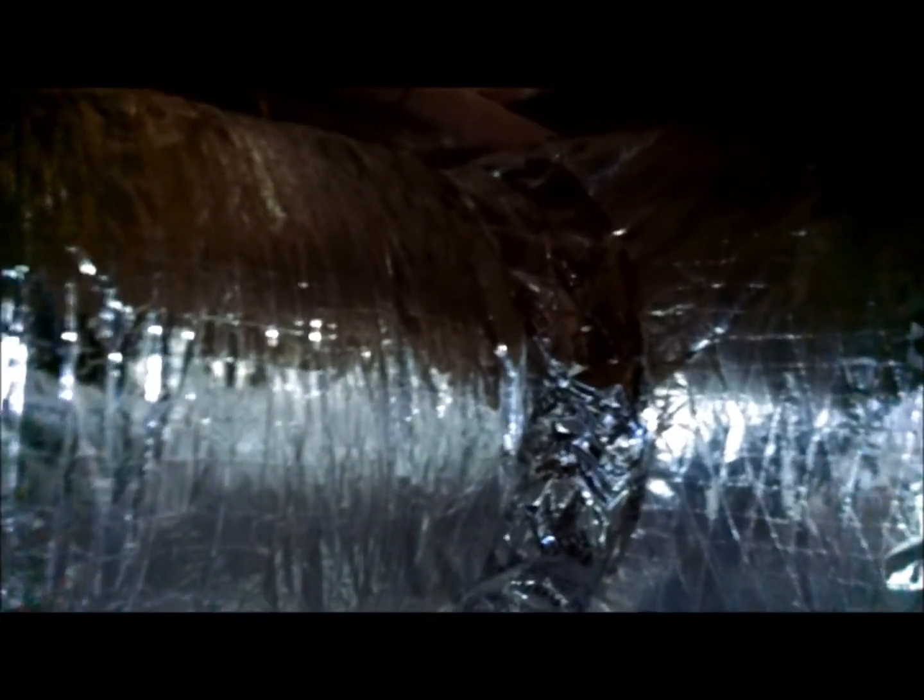and the flex connect, right there at the damper. I want you to see how that's nice and taped off all the way around the collar, and there is literally no airflow coming out around this collar right here, which is very important. That means that the air that is coming out of the coil or out of the furnace is the actual air temperature as close as possible to the air temperature coming out of your vent. So instead of losing 10 degrees from the unit to the vent, you may lose just 5 or so. So much better alternative.